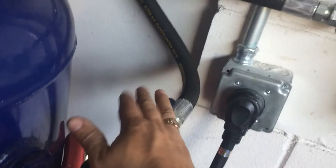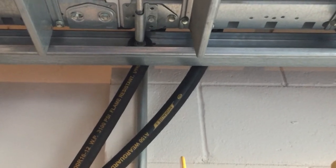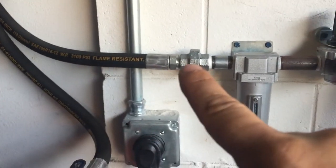The reason I used that is to disconnect the vibration from the rest of my hoses. You can see there are two flex hoses running up to the ceiling of the shop — which is the garage. This is the up-run which goes into 3/4-inch — actually I think it may be 1-inch pipe, but I believe it's 3/4-inch — running 20 feet, with two elbows, coming back with another 20 feet, and then running through the second pipe down here.